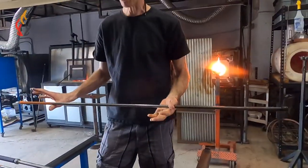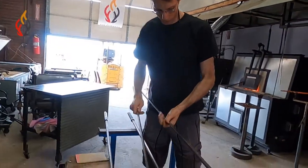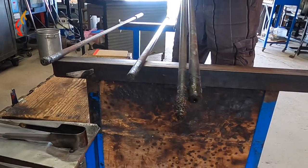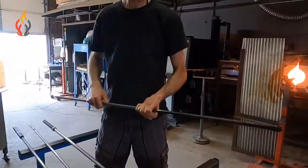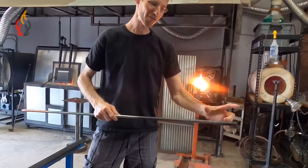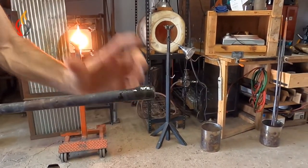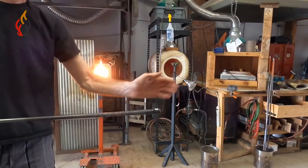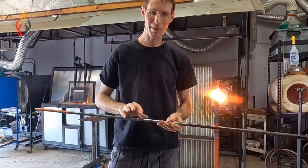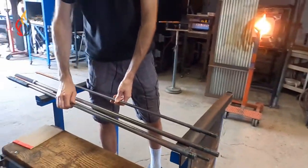This is a smaller one — what we call a cup pipe. These pipes are a little more than half inch, probably a five-eighths thickness on the body, and it is hollow all the way through with a slightly flared head at the top. Same thing with the punty rod, there's a head welded on here with a slight taper outwards, which allows you to get a little bit more glass than you would if it were the same diameter as the rest of the pipe.